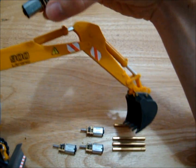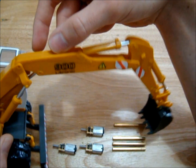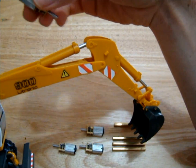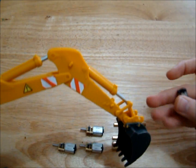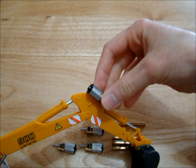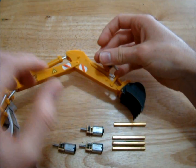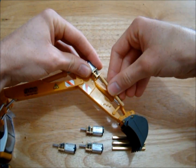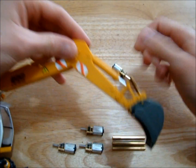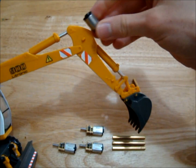If I were to put the motors into the middle of the arm I'd have to expand the arm a bit - it'd be a little messy. But if we put them on top we can always change it later if a smaller version of this motor comes along. The only tricky part is for this one I'm gonna have to remove this hump in the arm because I'm gonna need the motor to connect to this cylinder. You can see it's pretty small - there's not much space for the motors to go into the arm that way, so putting the motors on top is the best way to go.